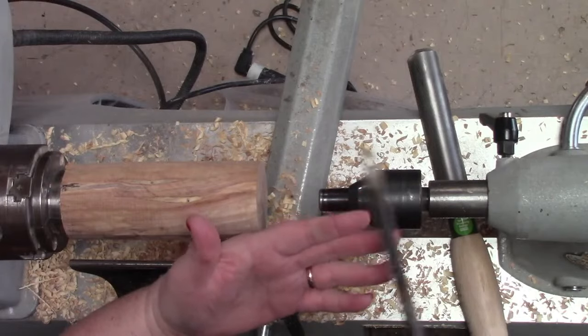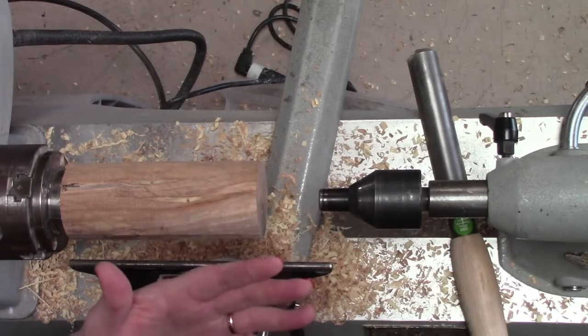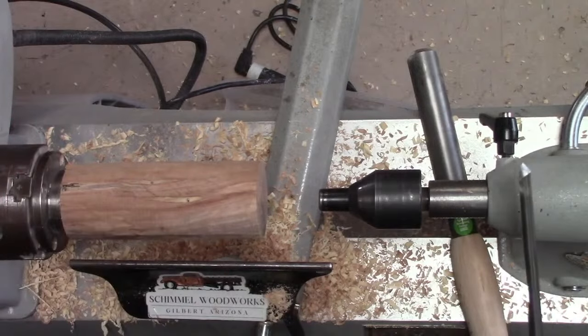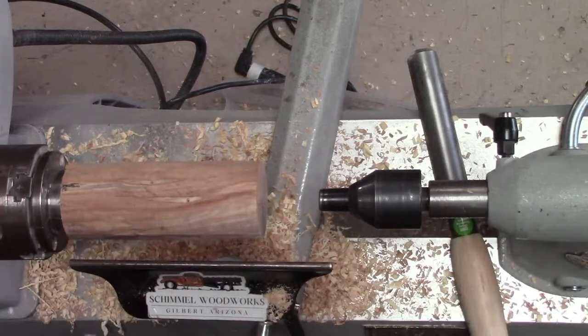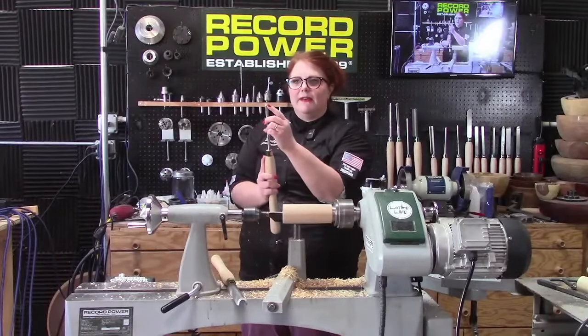It's what I learned with when I very first started turning. My first turning instructor told me, this is the most dangerous tool in the shop, and held up a skew chisel. So I was terrified. I hated roughing out corners. It was scary. I made him rough everything out so I could then have fun and do the smooth turning. Yeah, I don't even care anymore. So I prefer this. It works really well. I sweep back my wings. And here's the trick with tops. We are going to follow that bevel.